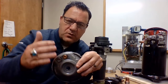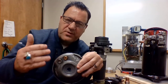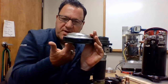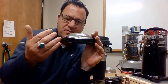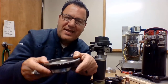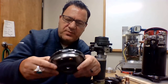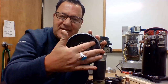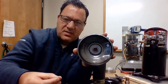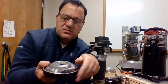The IPR, if you look at that in an AE bulletin, you're going to see typically, depending on the model, 375, 225. That's a differential between high and low pressures. The condenser gets mad at too high a pressure, and it goes off. It keeps it from becoming a catastrophic problem and causing more damage than needs to be. It shoots that hot gas again down on the inherent protector that's wired in series in the windings that goes off on high amps or high heat. So those are those two things.